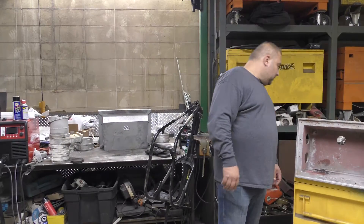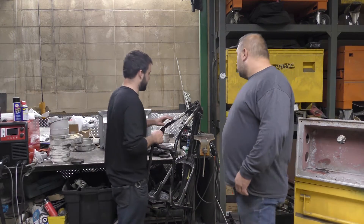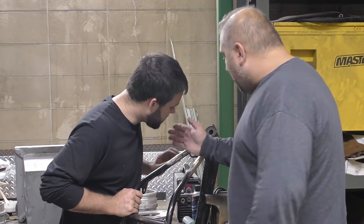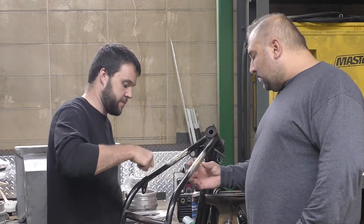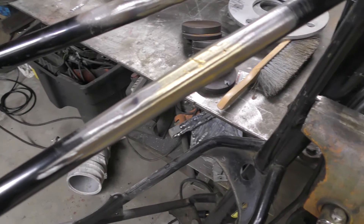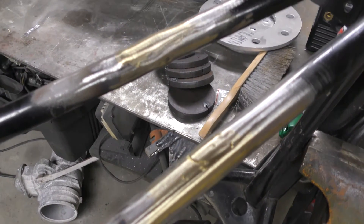Do you have a tube polisher for that? No. Come on — eBay, 300 bucks. What's that, a silicon bronze? Yep. So what happened is the guy had some heel bars on here, tightened them down and crushed the original pipes, and the guy says can you cut this out and put new ones in? I said yeah I can, but I'm not going to. I can also just fill the hole in. Yeah, it's a lot easier and more stable.